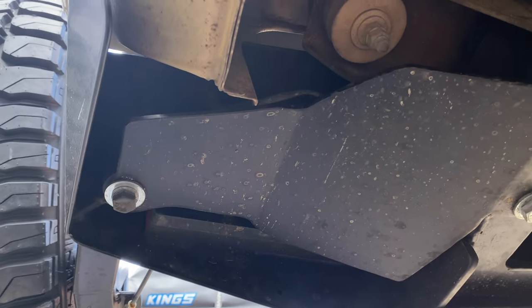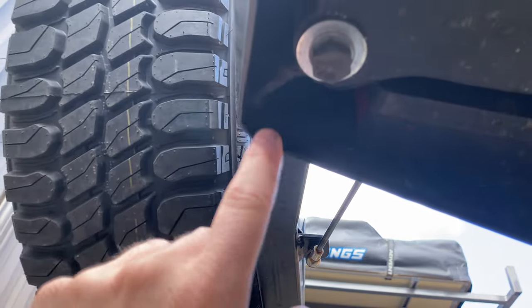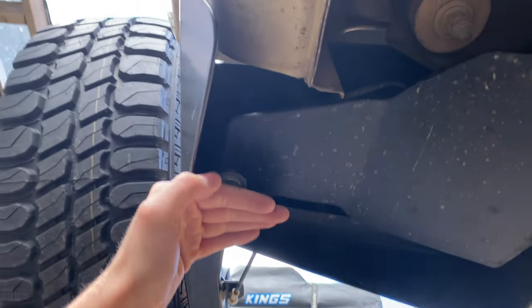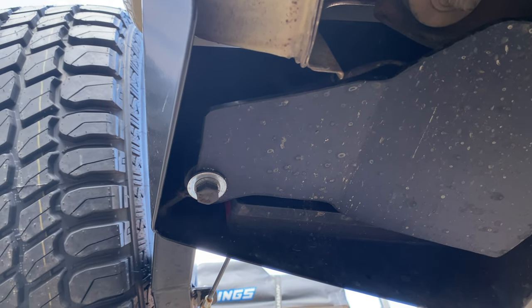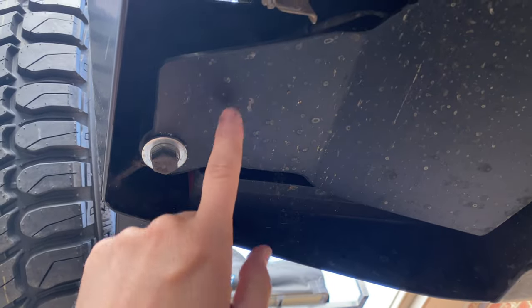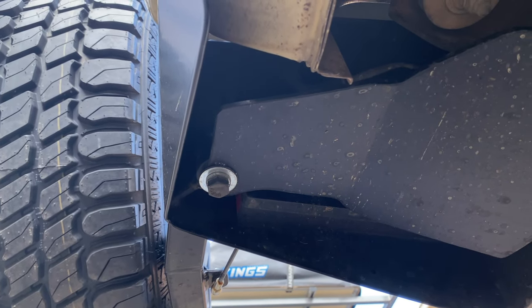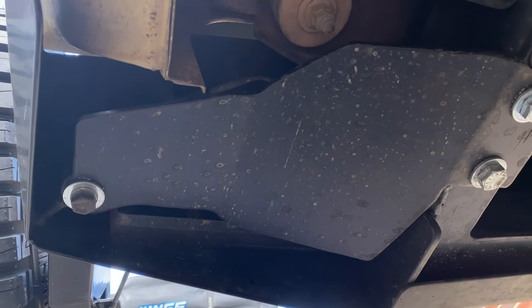The biggest flaw I didn't think about was the amount of wobble on the spare wheel. The part that actually cracked was a little section on the spindle, so I had to take it out and weld it back up. Then I needed a solution to stop the spindle movement. I drilled an M12 bolt up through the middle of the spindle — I didn't want to weld it because I still need to get the light out — and made up a plate, bent in two places, tying it into the original tow bar bolts. This has stiffened it up incredibly and it doesn't wobble anymore.